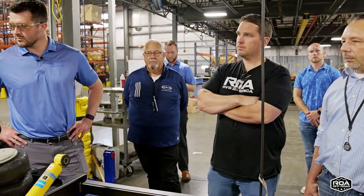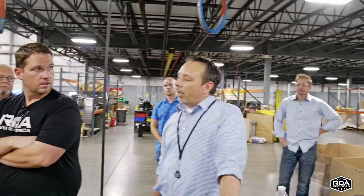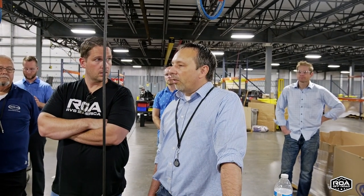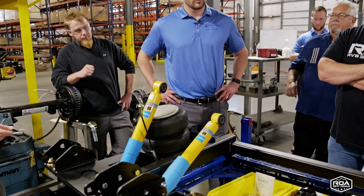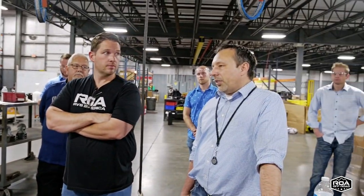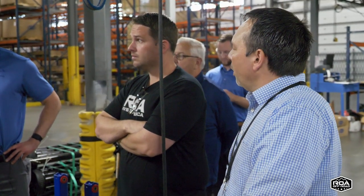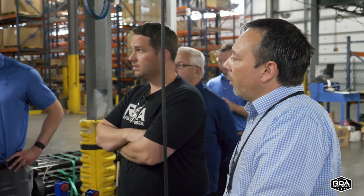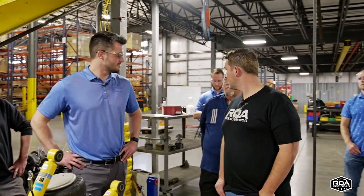Can you put too much air into the airbags and blow them? No, we max it out at 100 psi, so they're good for well over that. That's why I set it there. But what if a customer used the external Schrader valves to do it? I'd have to check the specs, but I think it's over 150. You'd have to get way up there. You could probably get 300 pounds, but I'm sure something bad will happen. Yeah, don't do that.